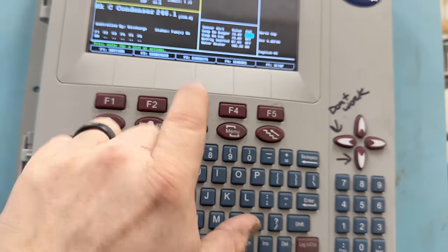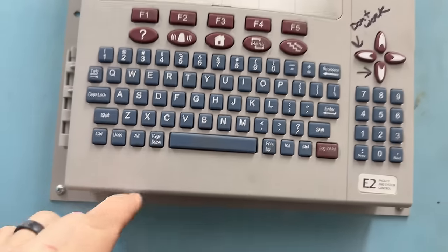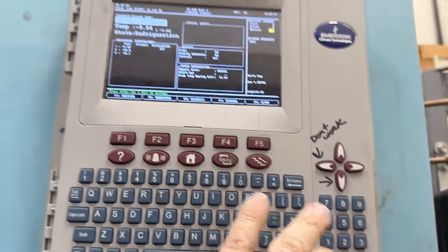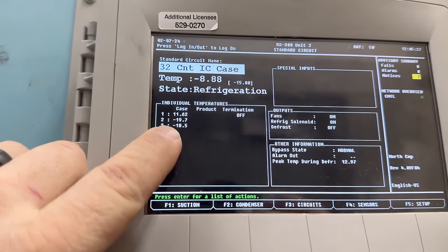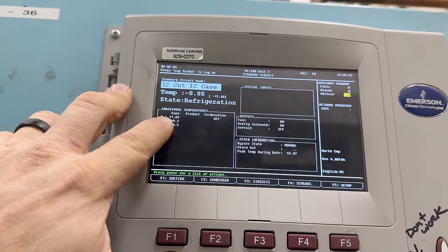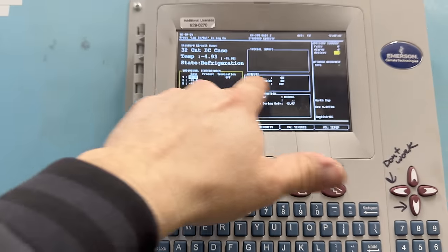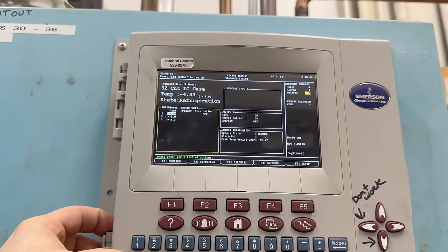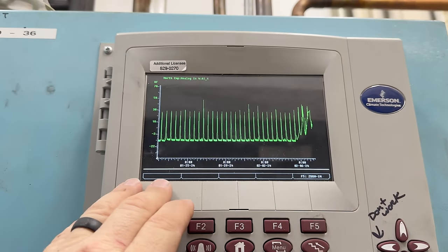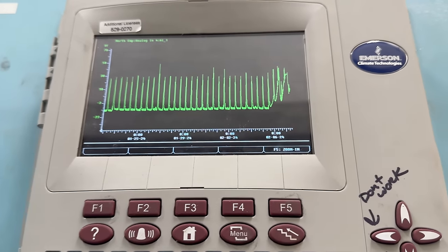So we go back in here, go under circuits. I like going this way — down doesn't work, so let's hit page down. Gets me to the bottom. Go back up to 32, hit enter. We've got two cases at negative 19 and 18, the other one's at 11. What we need to do is check and see if that temperature sensor is accurate. If I hit the tab key, I was able to bounce around. There's 19 — now I can hit enter and I can graph that. You can see things got stupid recently. Let's go see if we can see what kind of temperature it actually is.